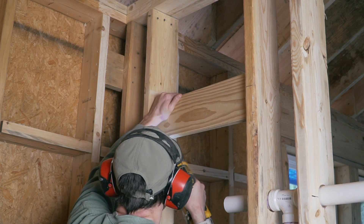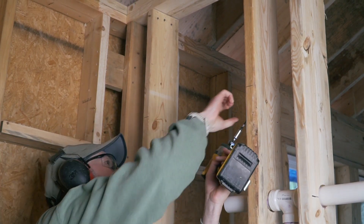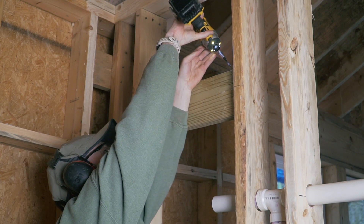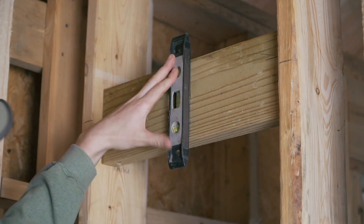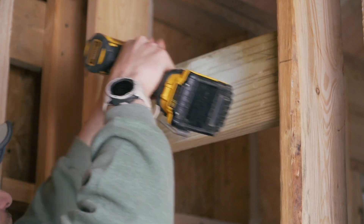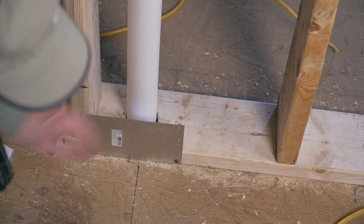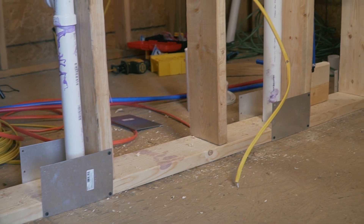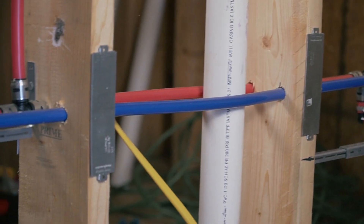I usually try to remain calm, but the wood was splitting and it wasn't working properly, and sometimes I just lose it. I still need to go to Lowe's to get some missing plumbing items, so in the meantime I installed all the protection plates to go over my water lines and also where all the plumbing goes into the bottom plate and the top plate of the wall. It is a code requirement. You have the large plates for the bottom and top plate, and the skinny ones go directly over the stud width.